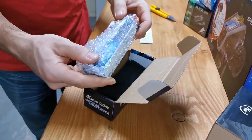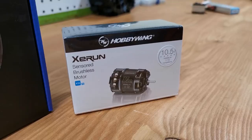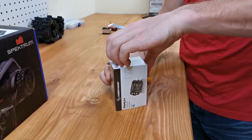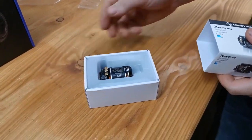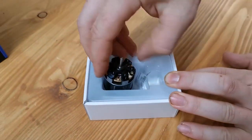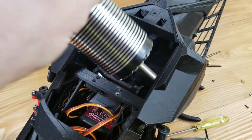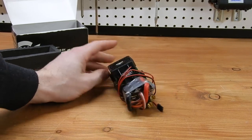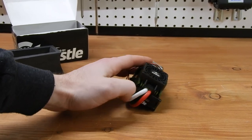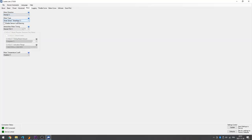The last important item in this system is the motor. The battery supplies voltage and power, the ESC controls how much of that goes to the motor — so all three items are interconnected and need to be balanced. The motor will overheat and over-rev if you push too much through it; there's no hard limit, it will just eventually fail from heat. The motor is quite simple — it's only three wires leading to three coils, and sometimes a sensor port. On a non-sensored unit, to reverse rotation you just swap two of the three wires; on a sensored system you do it in the ESC software via a programming card or computer.